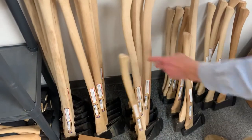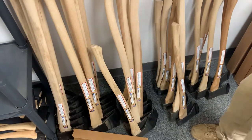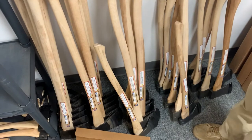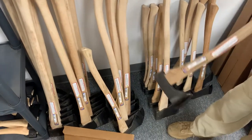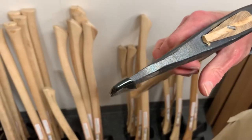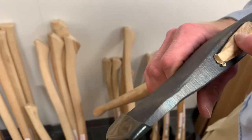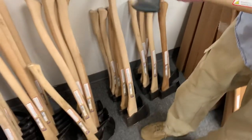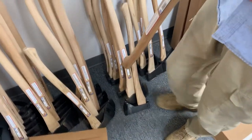When it comes down to it, it doesn't matter other than what you like. If I were buying an axe for other people to use, it's going to be one of these cheaper ones. The handle is not going to break under normal use; any handle is going to break under abuse. So I'm going to get a cheaper axe so when my friends screw it up, I'm not sick about it. This one has the little round wedge — even those can have splits, but this one doesn't. When I re-handle, I don't put the metal wedges in. I do add a little bit of glue, and I put super glue on the seam when I'm done and wipe it — that seals it in good enough.